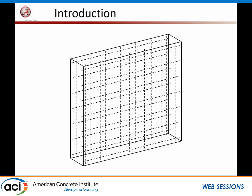I'm going to use this first slide as a schematic because I can't show the actual drawings, but it represents a wall in the interior of a containment structure. A typical wall has reinforcement in both directions, two mats of steel, and these walls tend to be very thick — ranging from about 18 inches to three feet. They're very heavily reinforced, with ties running between the mats of steel, making construction very difficult. The desire was to go from conventional ties to T-headed reinforcement, which is much easier to put together, but the NRC wanted it demonstrated that this will work the same.